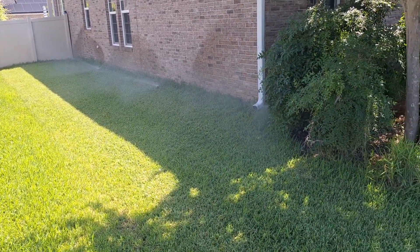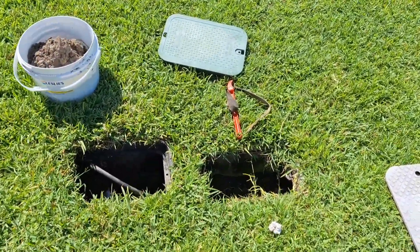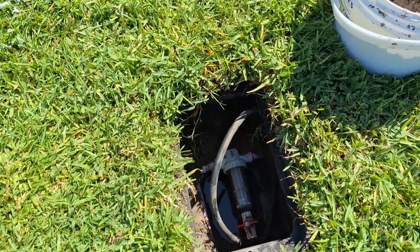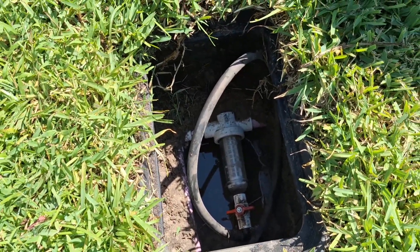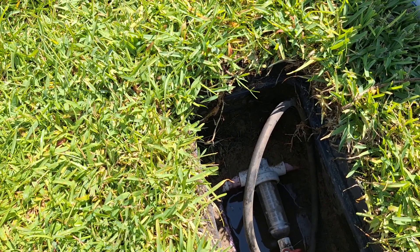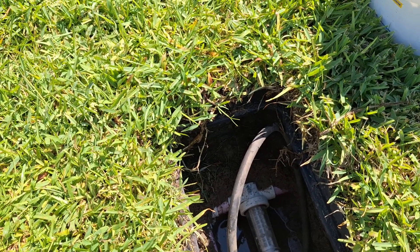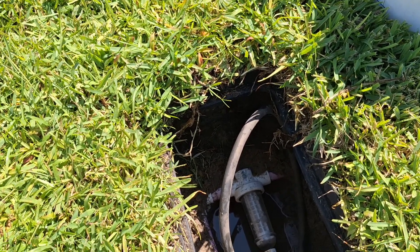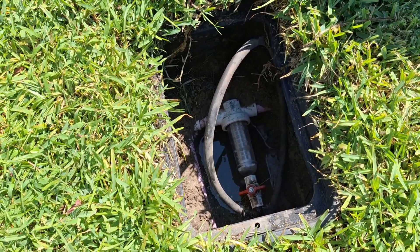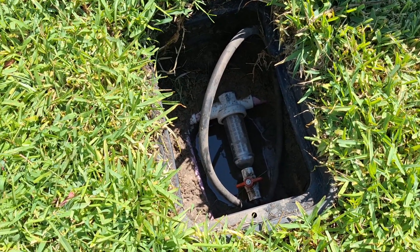Add a filter to your system — it'll save you a lot of troubleshooting. You get your main cutoff coming into your filter, you got a hose to test the city pressure, and the only thing I would recommend doing is putting a cutoff valve between the filter and your sprinklers, so when you take your filter off your whole system doesn't back-drain into your sprinkler hole. Like, share, subscribe — hopefully this helps, have a good day.